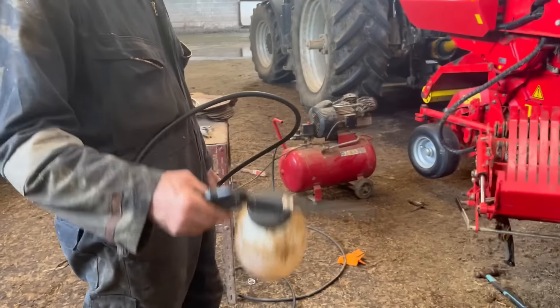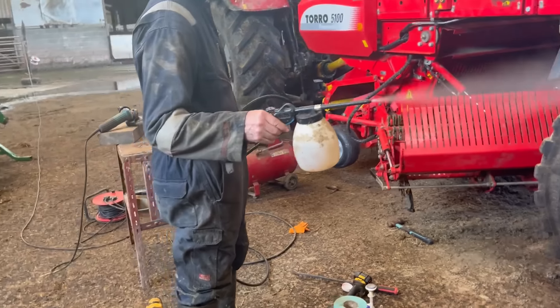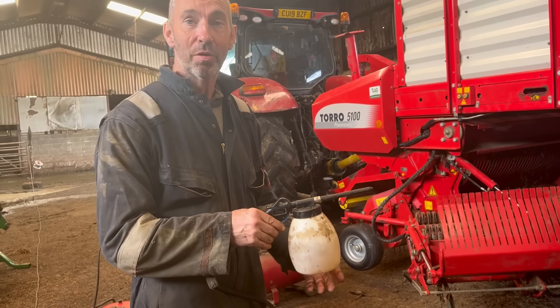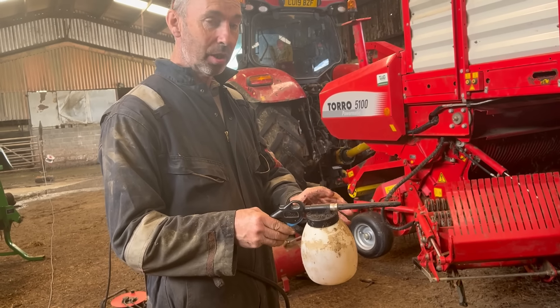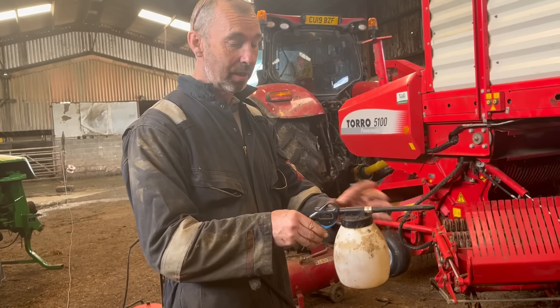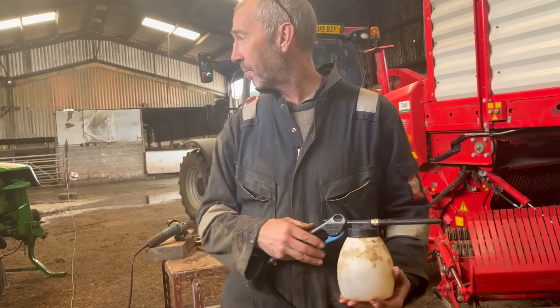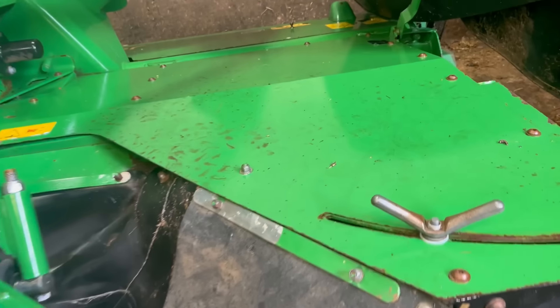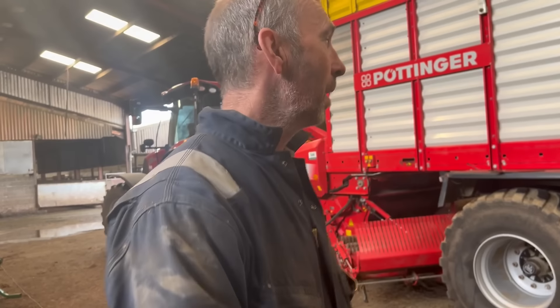Right, so now we've got yet another attachment onto our compressor. That is oil - yeah, it's a thin oil, it's H32. It's just an oil that I've got a big barrel of which I don't use for nothing else. It's good in this situation because it's quite clean oil, it's nice and it doesn't look dirty when it's on the machine. It's thin and it goes through this system nicely. You can see on the mower behind - I gave that a spray yesterday - you can see it's got that shine on it. It just helps things not to rust so much. So what I'm going to do is spray the back of those blade holding mechanisms so it gets all suppled up and the blades should come out a bit easier next time.